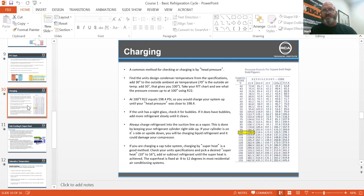My son is a chiller tech that works for NASA in Los Angeles. They were working on a system where guys overcharged it by 60 pounds trying to charge the sight glass. All those guys cared about was that clear sight glass, and the high superheat on a hot box was driving them to pound refrigerant in. The sight glass is not a good indication of your charging method. Get with your service manager and talk about the multiple ways of charging.